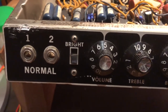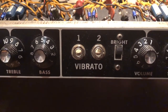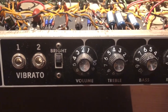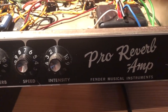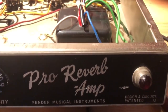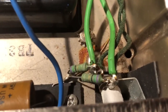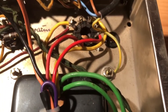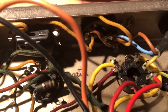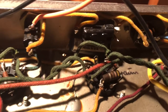Let's take a look at the chassis. The knobs and faceplate show some wear, and honestly I like it when a vintage amp looks vintage. The tinkerer who worked on this amp before attacked the artificial center tap — not really a good job. He installed a three-prong cord but left the ground lift and the death cap in place. The safety wire was stripped and stuffed under a washer — not really the safe way to do it.